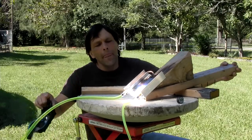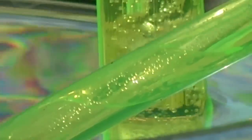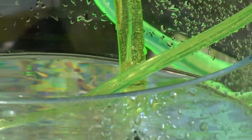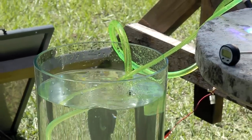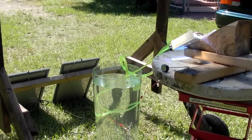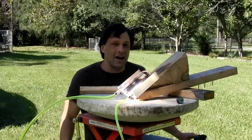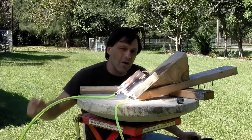That way, A, you don't destroy your equipment, and B, you're putting light over a larger area so you can transfer heat to more water. We have right at seven gallons of water inside that tank. The starting temperature was 63 degrees Fahrenheit. It's probably the most beautiful day of the year — about 58 degrees out right now, not a single cloud in the sky. So we're getting a really good result. I'm going to see how long it takes to heat up seven gallons of water with this setup. This Fresnel lens is a spot Fresnel lens, a little bit more than a square meter.